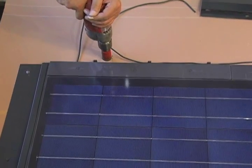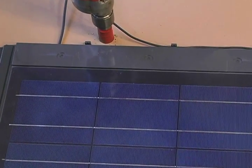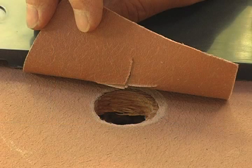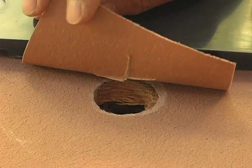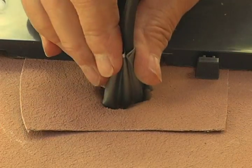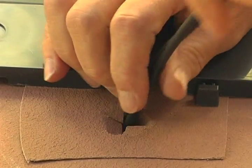Once you've completed the final course, you are ready to drill the roof penetration hole through which all home run cables will be inserted. The hole should be drilled near the top of the final course so that it can be covered with the top vent. We recommend the hole be lined with underlayment to avoid chafing the home run cables. Once all wires are inserted, the hole should be filled with fire-stopping foam or silicone.